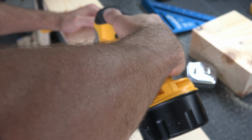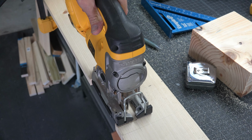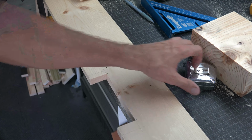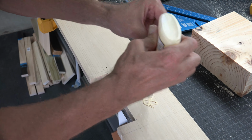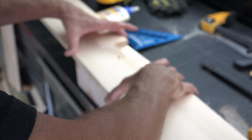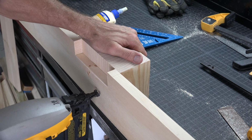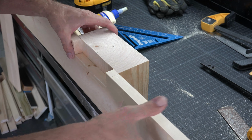This will be my jigsaw puzzle piece and will help me put it together after transport. It will also make the base a lot stronger. Instead of boring straight cuts, this made making the bed a little more fun. Too bad no one will see my creativity. Once your notch is cut, take some wood glue and glue your block into place. Flip it on its side to make sure it is flush, and you can simply nail these together or cheat like me and just put some staples in it until the glue dries.